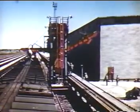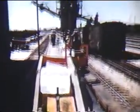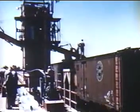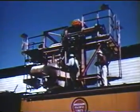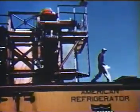At Rio Grande's modern North Yard in Denver, this is handled speedily with unique track icing machines, which gobble up a steady stream of ice cakes moving on conveyors from the ice house, crush it to proper size between spike-studded rollers, and deliver it through movable chutes directly into the bunkers. These self-propelled monsters were developed especially for rapid and efficient handling of perishable crops. Two 85-car trains can be serviced at the same time, and average icing time is only 1.5 minutes per car.